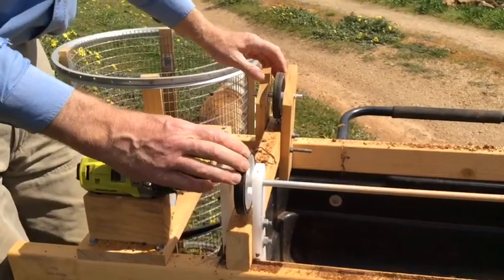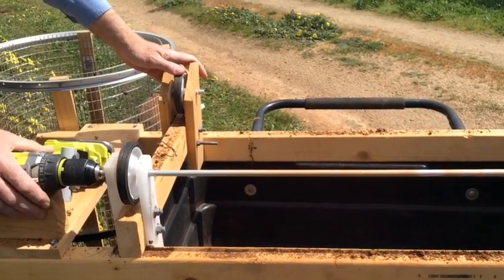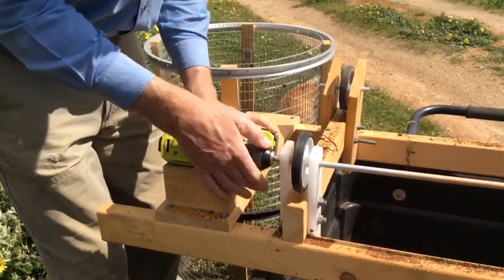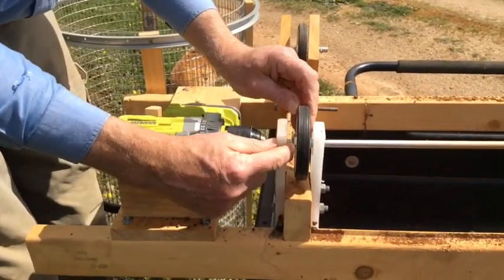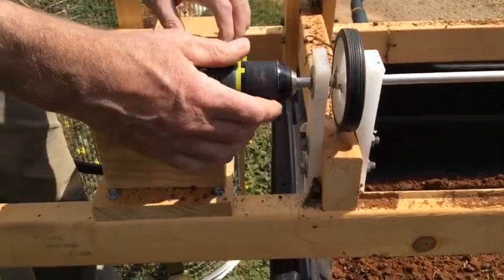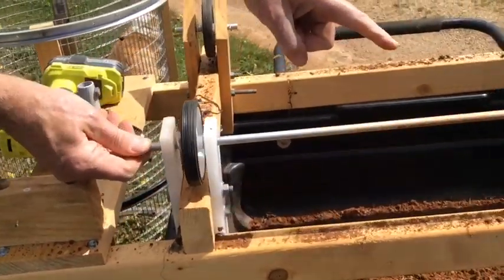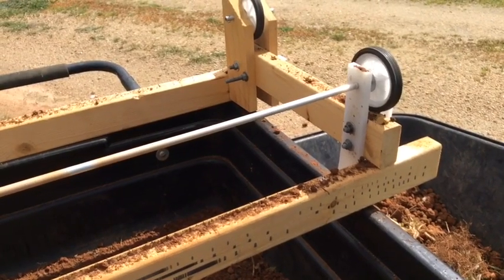The wheels were maybe three or four bucks, a bit of aluminium a couple of bucks, some nuts and bolts, and of course your trusty drill. There's a little bit of effort lining everything up so it's completely aligned with the fixed axle. I've drilled a couple of little holes — the wheels are fastened with wire going straight through the axle so that when it turns, the whole axle turns. It's a two-wheel drive setup. I thought about one-wheel drive but figured it would probably slip when it had a bit of weight on it.